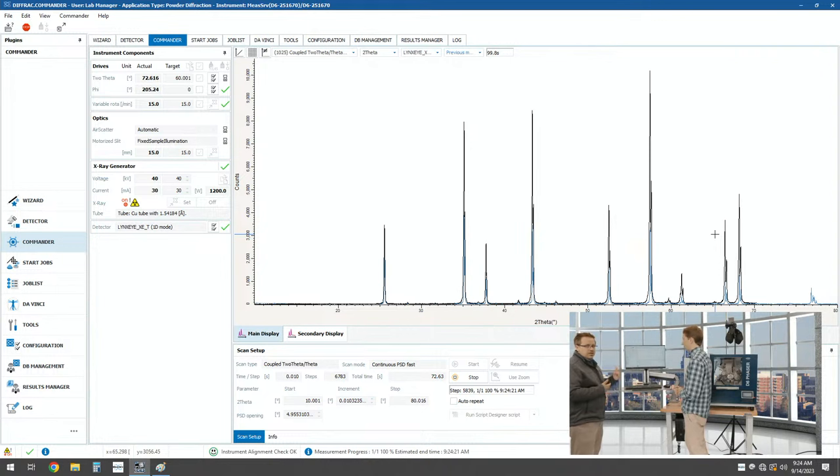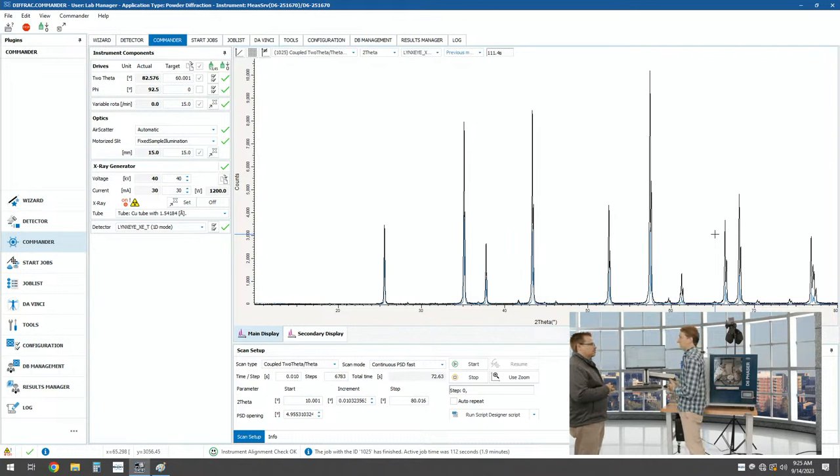Mm-hmm. And one other thing to note for everybody out there is that we did see how the intensity, or the background, goes up over time, but you can bring it into EVA and it has a normalization algorithm. That's right, because we know exactly how big that slit is. There's an intensity correction that we can apply in the software. Yeah. And if we intensity normalize it, the scans will basically look exactly the same, except we'll have much better signal to noise at the higher angles. And that's where it matters, because...